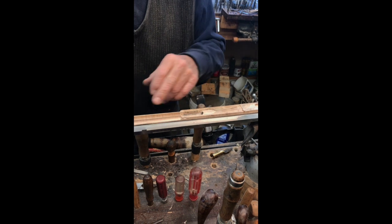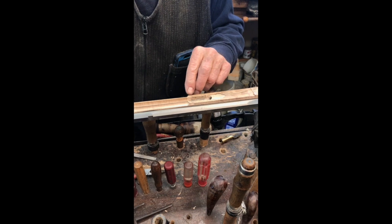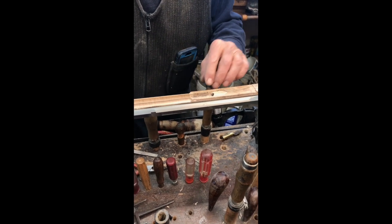Here's our panel that's going on. Now I used to stain the outside here before I did this, but once it's done, the epoxy is going to ooze out and seep on top here and down over the barrel and everything. But we cut that off and we'll resand this, and there won't be any stain or anything left. So I was just wasting my time to do that. So I'm not going to bother putting the stain on it. And actually, I think I am on this one.